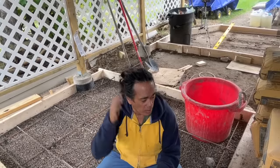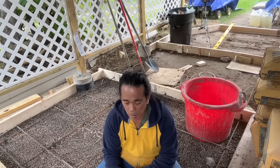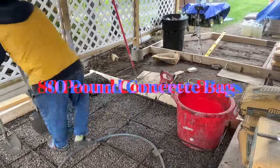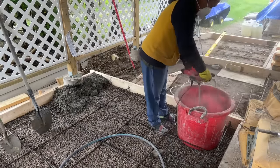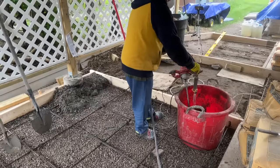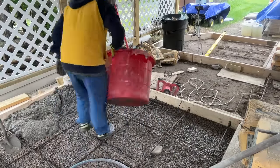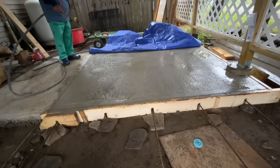I have everything together so I'm not searching for tools — I'm going to do this slab right now and maybe the one behind me. It's a six-by-seven slab so it should take at least a couple hours. Before laying the concrete I make sure everything's pretty wet. I found it easier to mix bags in halves so there's not too much strain on the mixer. I empty the concrete in, mix it around, add a little more water, and repeat — about 24 times. Since I don't have my dad with me, this is the way to go. There is the final product — just watering it down and putting tarp over it for the hydration process.